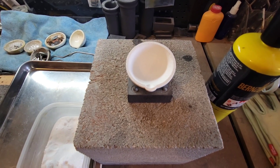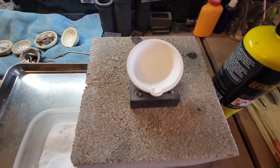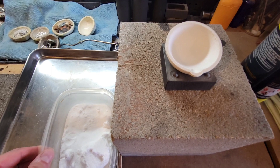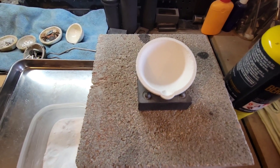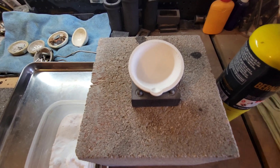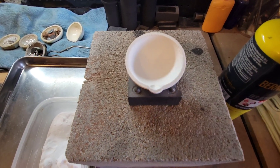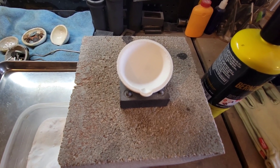The first thing you're going to do is heat up your crucible with your torch — get it so that it's red hot. That way when you sprinkle your borax onto the crucible it'll instantly start melting and glazing. If you were to just put borax on the crucible before heating it and then apply your torch, the torch is going to blow that borax straight off the crucible and you'll find that you'll just be doing that over and over.